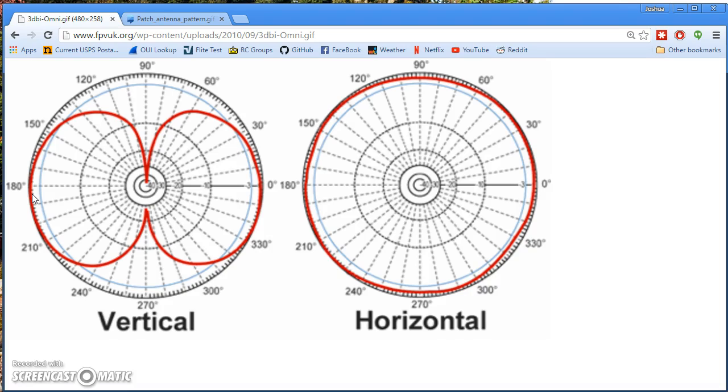I'm not going to get into a deep discussion of what a dB is - that's a topic that takes a lot of time to teach. Suffice it to say that this line is the benchmark for signal strength. It's not an absolute value - whatever you measure close to the antenna will be strong, and far from the antenna will be weak. The further in the red line goes the weaker the signal is, and the closer to the 0 dB line the stronger - but it's all relative.